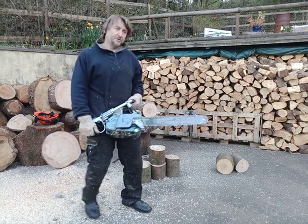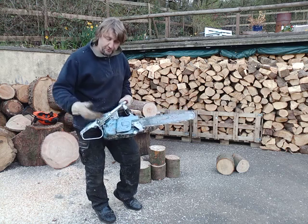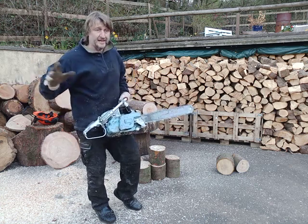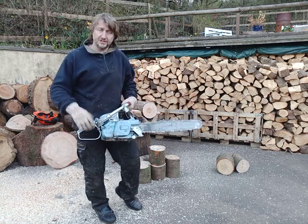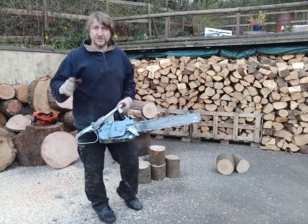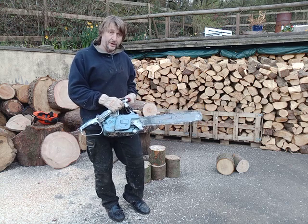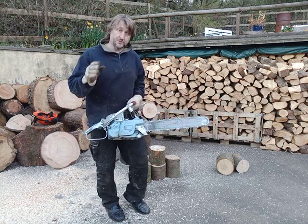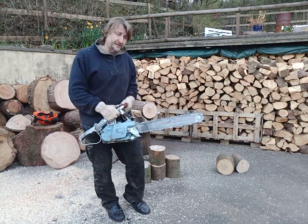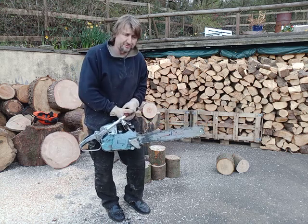Someone else mentioned my oil mixtures. On all my saws now, having spoken to a few people who were cutting with some early Stihl and early pioneer saws over in Germany in the Black Forest, they're now using just the highest quality fully synthetic at 50:1 on all their saws. So I mix all of mine at 50:1 plus a strict 10%, so my effective mix on every saw now is 45:1, apart from some of my war saws, the ones from the 40s, late 40s. Some of those I still use mineral mixes on, and I'm very, very reluctant to even attempt to change those, just because their entire life has been run with something so different.